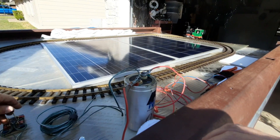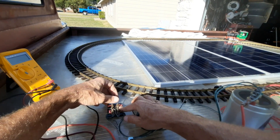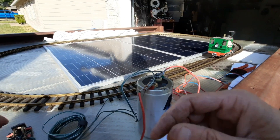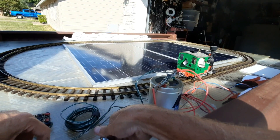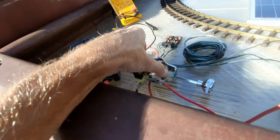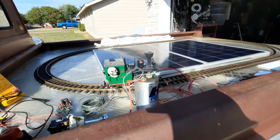We can go forward and reverse fast — if power stays on, the capacitor charges really fast and we'll get fast starts. If we cut the power it'll give us a slow start and a slower burst too because the capacitor can't charge as fast. That works. It's pretty involved — I had to use a half-farad capacitor. We don't really need the square-body light switch. This is our master switch and this is our forward and reverse switch. That's how you build a homemade speed controller for a train.